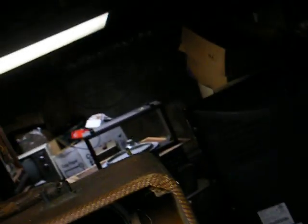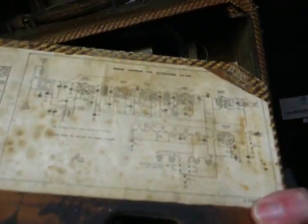Here's the back cover for the radio, and we still have our schematic diagram listed here. This radio uses an oscillator mixer stage, two IF stages, a detector first audio stage, an audio output stage, and of course the rectifier stage.